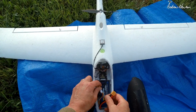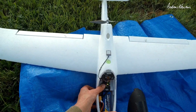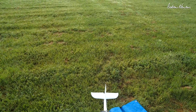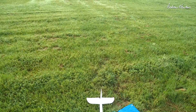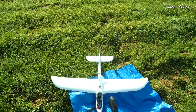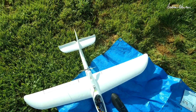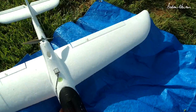Okay, ready to try the Kopilot Lite in the Ranger G2. That will beep until the GPS locks. That's manual mode. So that light's gone solid and the beeping stopped. Manual mode. Return to launch. Should be right to go. Oh yes, we've got throttle control. Return to launch. We've got throttle controls in stabilised mode, so let's give it a toss.